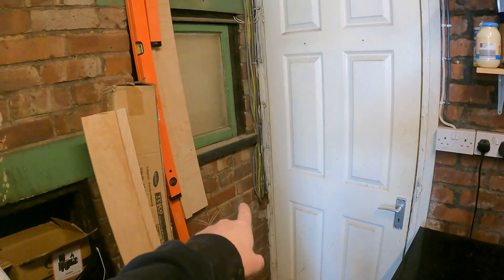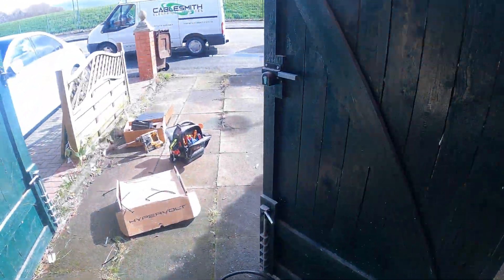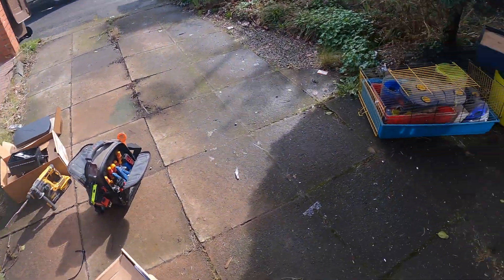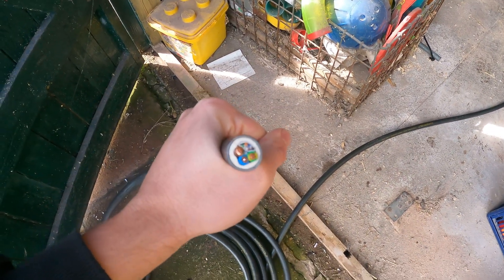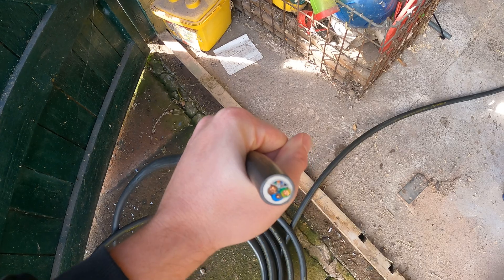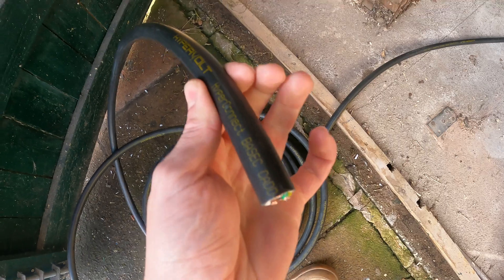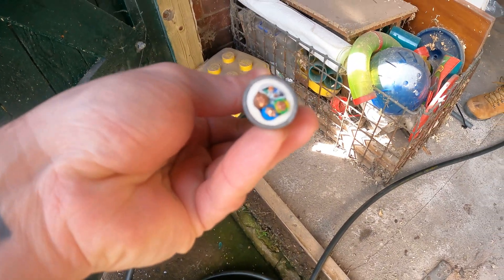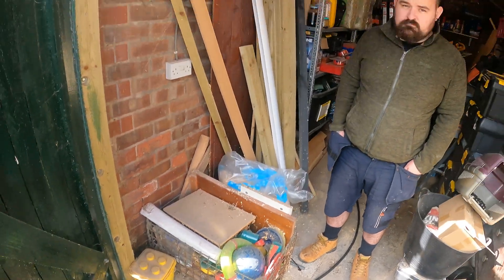Fuse board's on the other side of that — it's a fuse box RCBO board. We've just got a mini RCBO for that, so that is double pole. We're using Hypervolt's own cable, which is called Hyperconnect. It's a 6mm 3-core with a data cable inside that we'll be using for the CT clamps.